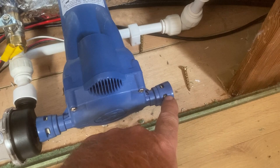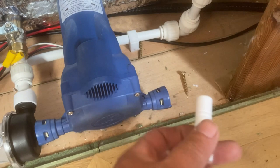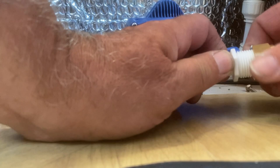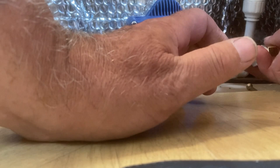Let me show you that. So the filter plugs straight in, but I was putting a 15mm pipe into there and it didn't seal it at all. So it turns out this goes in there, and that's why it says two clicks, because there's two ridges on there. So what I have to do is put one of these tap connectors on here that goes down to 15mm, and then that clicks in there,